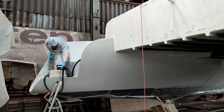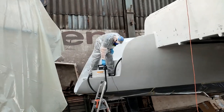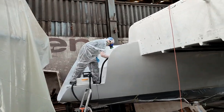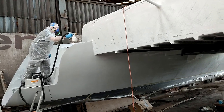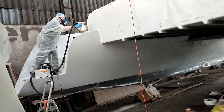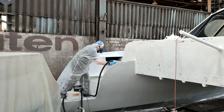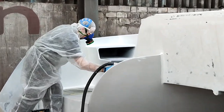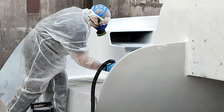After we were done with the first step of the sanding, we sprayed all the surface with an airbrush with epoxy primer again, just so we could see better where something was still not even, and to have a kind of first paint layer.